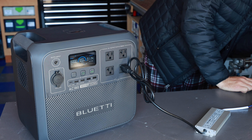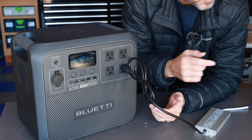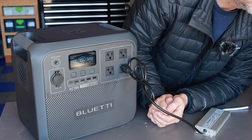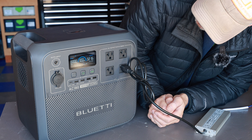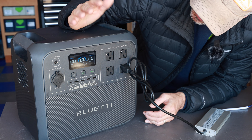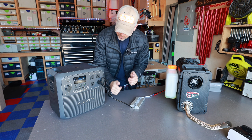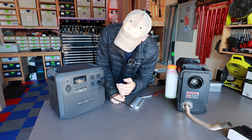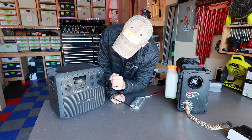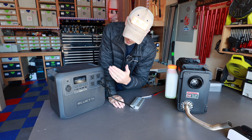Hopefully here in a few seconds you'll hear the diesel heater start clicking and get that fuel pump going. This is about where I was getting tripped off the cigarette plug — yeah, that was pulling over 200 watts. It's really fluctuating quite a bit: over 200, down to 120 watts. Still looking good, still running. 204 watts — I'm surprised it gets up that high for just split seconds. That takes way more power than I realized. I never saw how many watts it used because it kept tripping off, so I never really knew how high it got.